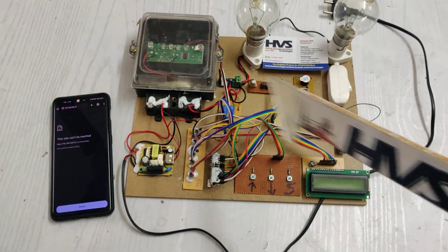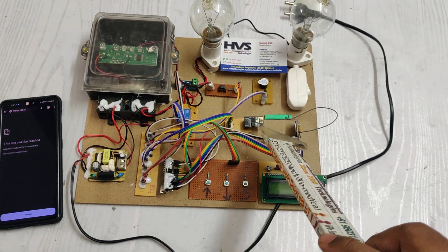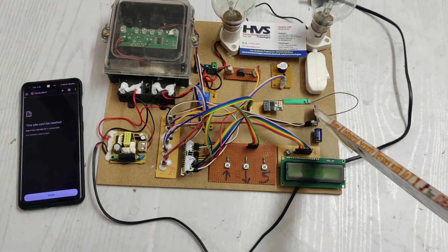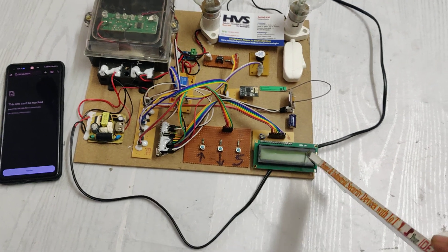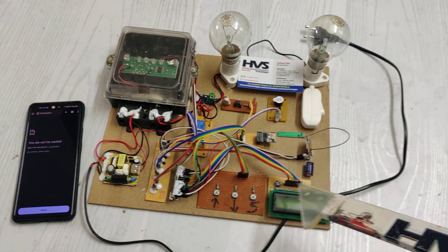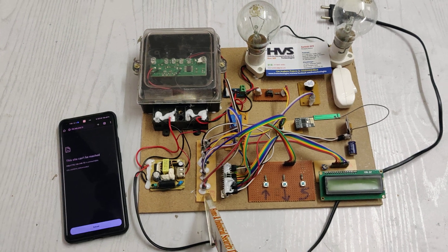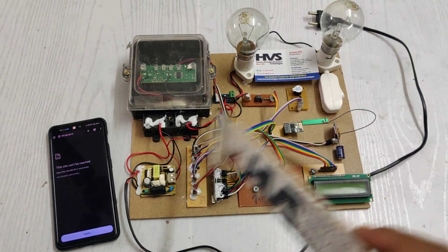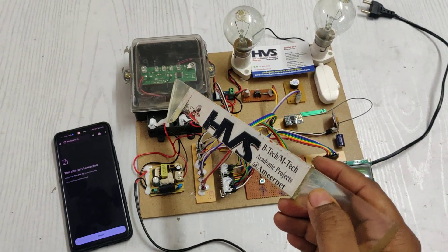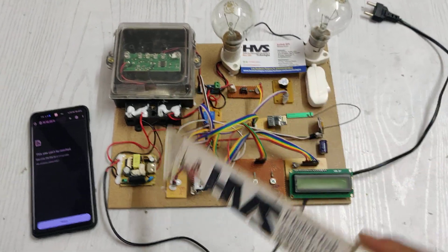These are the main features. To execute them, the main components used are: an ESP8266 Wi-Fi module for IoT purposes, a SIM800L GSM module for SMS alerts, an LCD for continuous status display, buttons to select options and adjust bill details, a breadboard to distribute the 5V power supply, and a 230V AC main power input fed into the energy meter. The output from the energy meter connects to the loads through an electromagnetic relay.